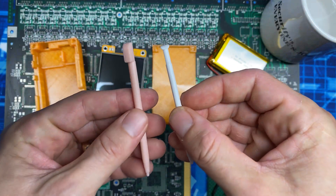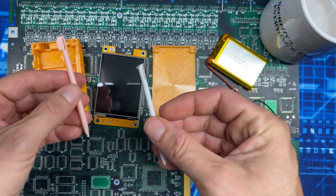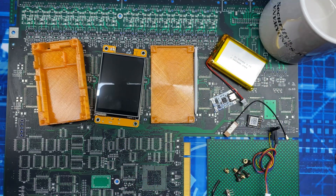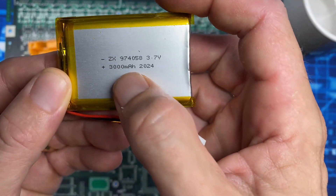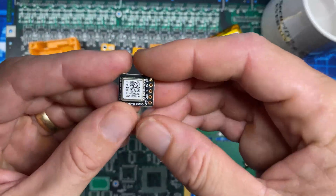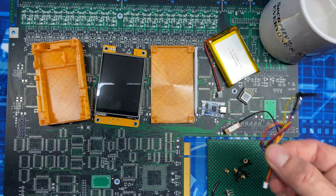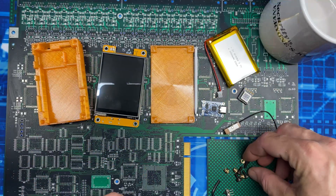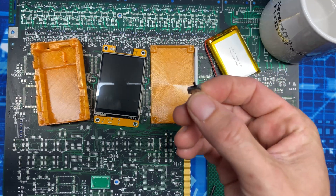The stylus that comes with the non-USB-C version is much bigger, making it harder to design a case around without compromising integrity, so I went with the one with the white stylus — the board with USB-C. In addition to the CYD board, I'm using a 3,000 milliamp-hour 974058 battery, a USB-C 1-amp charging circuit, the ATGM336H GPS module with its ceramic antenna, the plug that came with the CYD for wiring the GPS, four M3 by 6mm screws, some 3mm heat-set inserts, a slide switch for power, and the 3D-printed top and bottom case pieces.